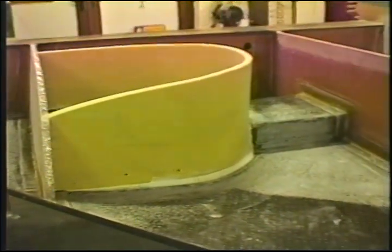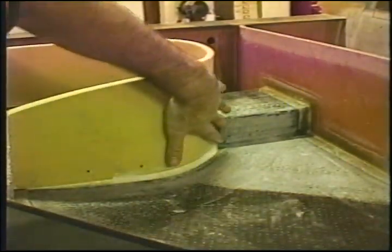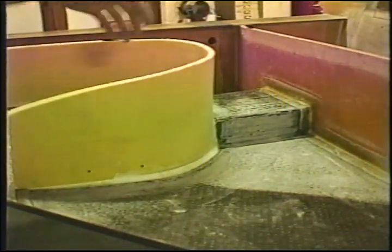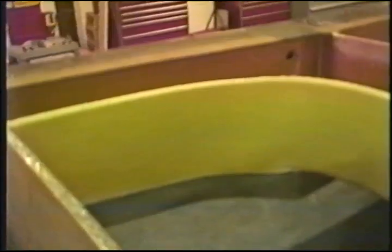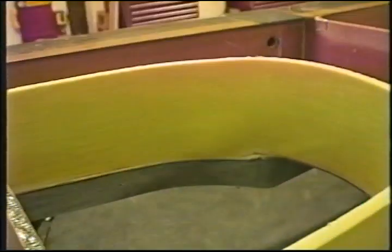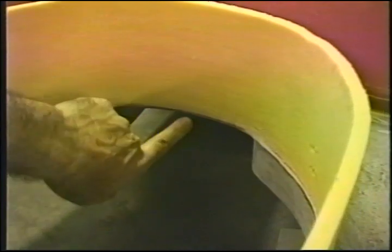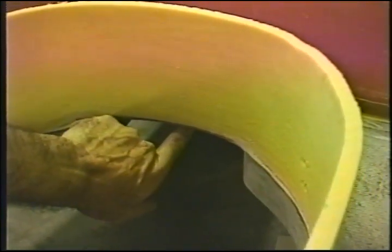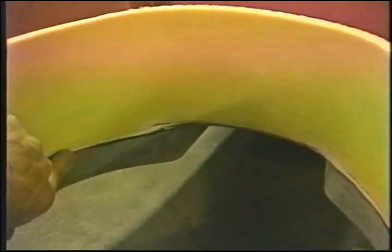Okay, we've got the top of the foam trimmed, all the micro cleaned up around the perimeter, all the dust sucked off the surfaces, the interior cleaned up in its entirety, and this edge radiused off neatly. Measure an inch and a half back, all sanded, this face sanded, all these faces sanded, and the micro cleanup along the edge.